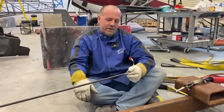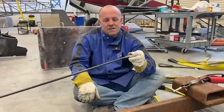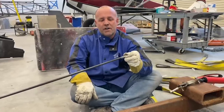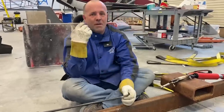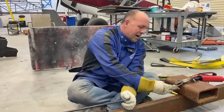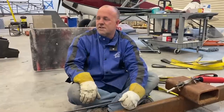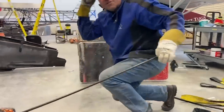But I could add a few more rivets to this, and I bet you, just by looking at where it failed, this is why we do these tests. I can go through, add another 5-8 rivets. I think I'm gonna push this over 5,000 pounds of ultimate load force. So I'm gonna alter my part. It's gonna be real easy. I made up my other parts long. I'm gonna just drill them out, cut them. It's part of the test. I'm gonna open up, add a few more holes to this. I'll do one more test later, but I could go with it the way it is and be 100% sure I'm stronger than I ever needed to be. So, success. Carbon fiber wins the race.